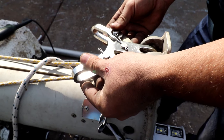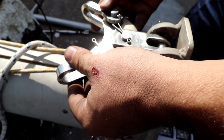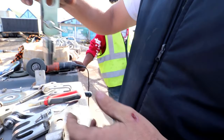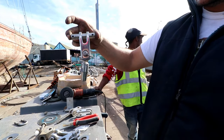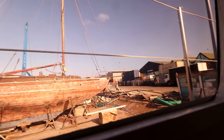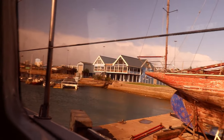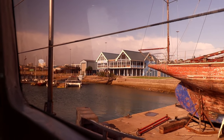I'm going to standardize the holes — they're not standard right now. I want to go to 13mm, so I'm going to get another plate re-cut and then go down to the standard 13mm hole, so the whole rig is standard. If we need to get gear anywhere it's easy, just make new pins. We've got a new strap for the other side. That's pretty much how our two backstays are going to be — the only thing changing is that plate. We'll make a new plate on Monday since all the metal suppliers are closed today. Check out that windsock — forecast is gusting 45 knots. Luckily if it blows from the west this marina flattens out, but from the east there would be a hell of a swell in here.